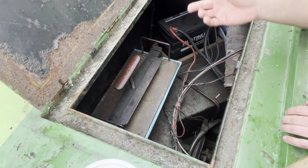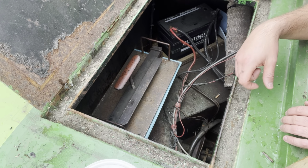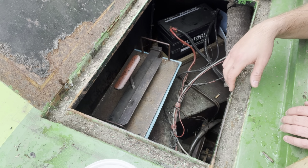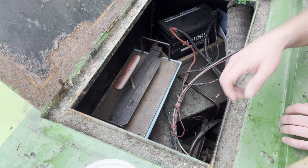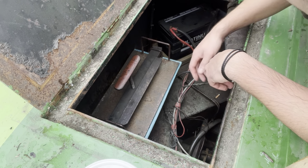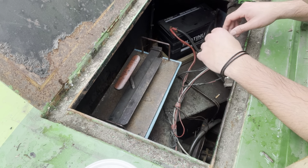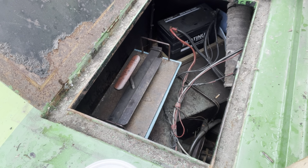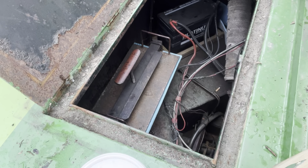So before I put the lid back on my stern floor, I'm going to turn the engine on and put it into gear for a second, just to see if anything drips out, because it would be awful to start moving, this not being tight enough and water coming in without you knowing. Obviously you can sink yourself quite quickly that way. So that's all fine.